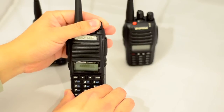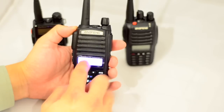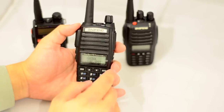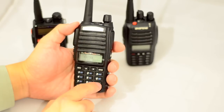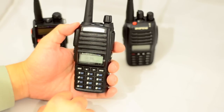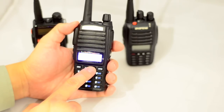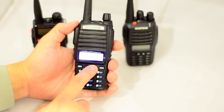Let's switch the radio on. As you can see, you have a similar size display screen on the UV-82. When you program it, you can display the channel names or numbers. In terms of programming, it's very straightforward — you can use the CHIRP software or the factory software online. I've spent about an hour or two using these softwares. The menus have around 41 options, and the different functions are very similar to the UV-5R.